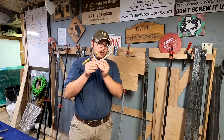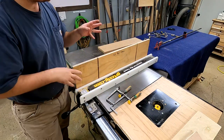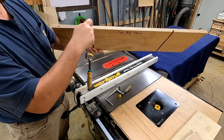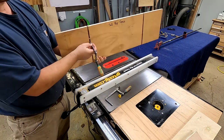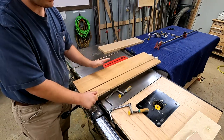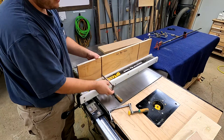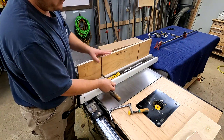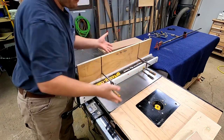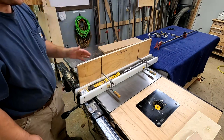One of the primary ways I use these dovetail clamps is on my table saw with jigs. I have a router fence that works the same way. You route these grooves in here and your clamp slides into those grooves — that gives you a hold-down that you can move to lots of different places. This is my tall rip fence — sometimes you just need a taller fence to do operations safely on a table saw. The clamp slides in, my clamps are dirty because I use them hard every day, but it clamps right there and boom I have a really nice tall rip fence.